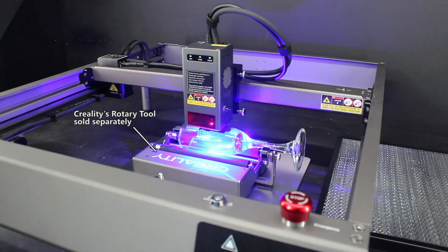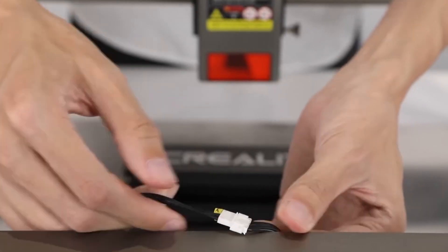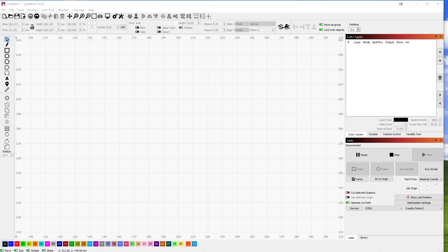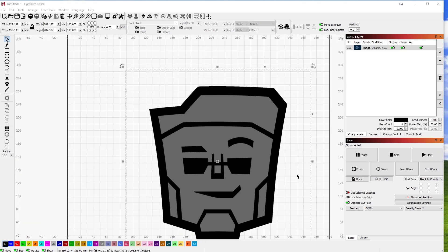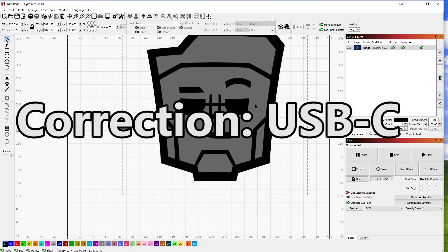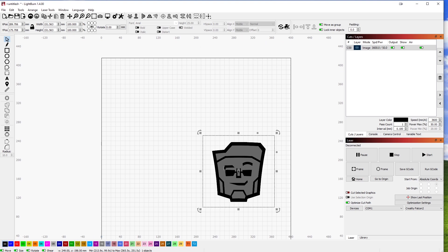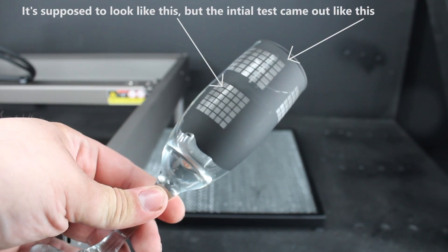However, getting this thing set up wasn't as clear-cut and dry as running the machine outright was. To get this set up, the first thing you need to do is unplug the stepper motor from the y-axis and plug it into the rotary tool. From there, you need to do all the mechanical setup, like installing feet risers and adjusting the rotary tool width to best suit what you need. In my case, I was engraving glass, so I also needed to prep the surface to be able to accept the diode laser — for which I used cheap acrylic paint. For running rotary objects, there's obviously no stop switch for homing, so it's most convenient to run from a computer. I didn't have a 15-foot micro-USB cable, so that was out of the question. I also found that by default, all my designs would come out elongated.